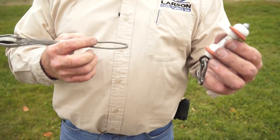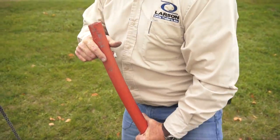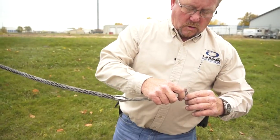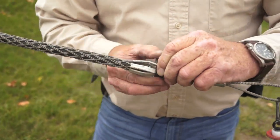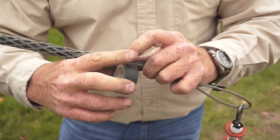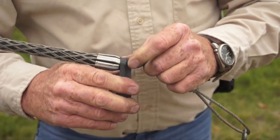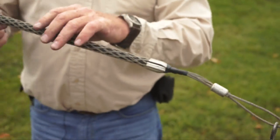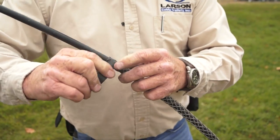We choose the missile. This here is a missile designed to go in the inch and a quarter. This missile will fit firmly in this inch and a quarter duct so that it will trap the air in there, so that we can use that to pull. We'll connect the cable and connect the Kellum grip with our clamp. I'll take my electrical tape and bring these shoulders down. I don't want the tape hitting the edge of the duct — plastic on plastic causes drag — but I don't want the quarters of this Kellum grip to catch the seams in the splices. The shoulders are going to ride through them splices rather than getting caught on the edge. We'll get some tape on the back end of our Kellum grip so we know it won't slip off the cable.